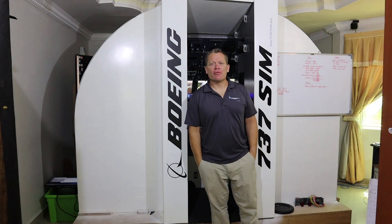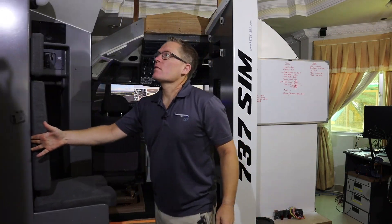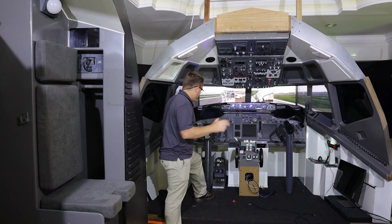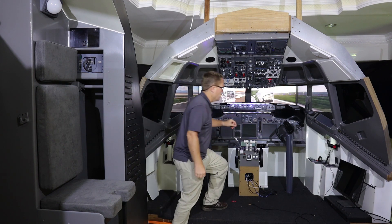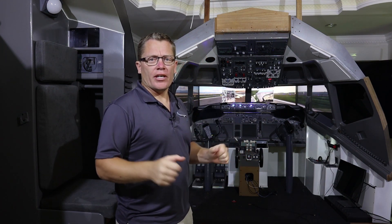Hello guys, it's a new day in the sim here in Brunei and after last night's flight experience, there were a few technical glitches with the sim which we need to fix today. So I need to get the sim opened up and show you what's happening. You can probably see the fault from there. What happened last night was we managed to disconnect the yokes. Obviously the downside of my design was you cannot take them past 90 degrees otherwise they lock out in reverse. This is going to require the floor lifted up and a redesign to add stops. Should be a quick fix.